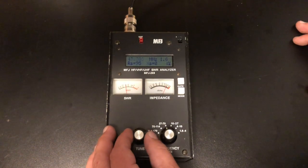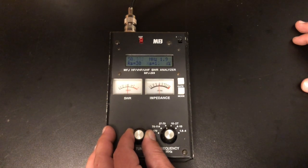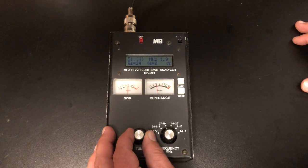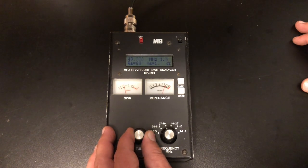I really have no idea what the frequency width for 10 meters is, but I know it's pretty big, and this is looking pretty good. So where is 50? This is where I hang out in this little swath of 6 meters, so that's pretty good for me. I don't really go higher than 313 for FT8. It's 2.2 at the high end and 1.3 at the low end. So it's actually resonant below the band — it might be a little long, but that is definitely usable without a tuner.